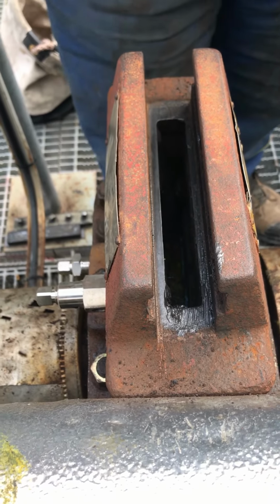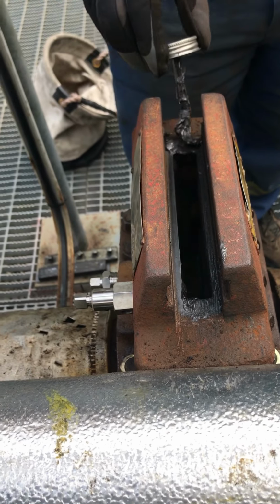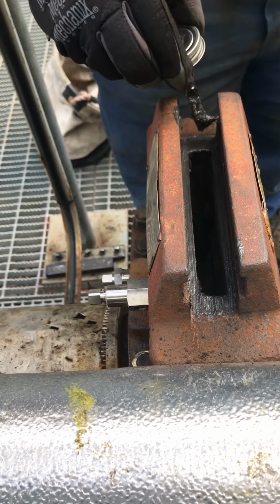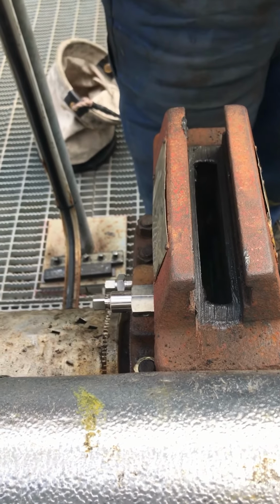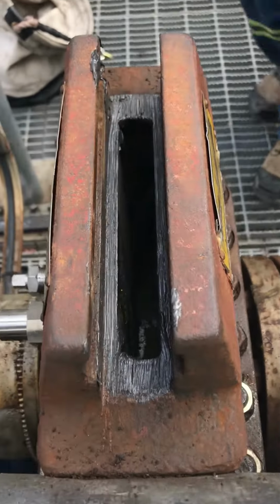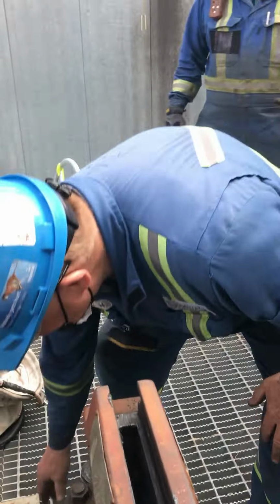And that's the thing when you're doing or changing or checking the orifice plate too, eh? Make sure you got some dope with you, a new 9A gasket. But if the gasket comes off because it's been doped and looks good, it'll go back on. So it doesn't hurt to put a little bit of dope on it and revitalize it, right?